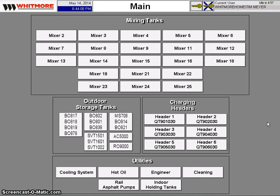So if I were to tell you the next steps, it would be electronic batch tickets. Electronic batch tickets are very important to our facility. Electronic batch tickets will be pre-programmed by engineers, so every step will be programmed into the automation system. So any manual steps that would come up, the operators will be notified as to when to add that material. But for the most part, the temperature set points, the bulk charges, the agitation rates, the pressures on the mill, everything would already be pre-programmed, reducing any variation that we have in our products.